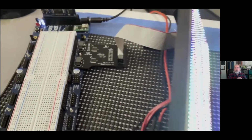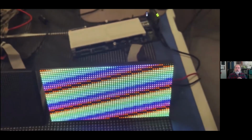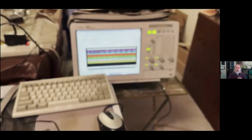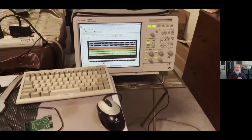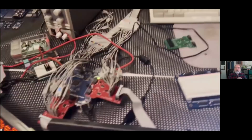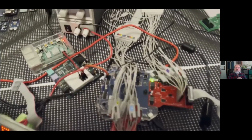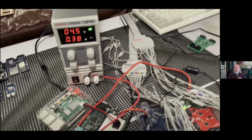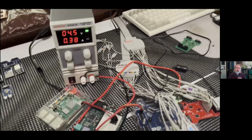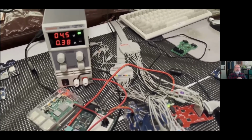And that is now driving this display. And then the noisemaker here, you get the background noise, that's our logic analyzer. We're cabled up right here to these guys. And I just pick which one I'm listening to at the time and capturing traces. And then a standard bench power supply, so I can tell what kind of amperage we're running. And it looks like it's fallen to 4.5 volts. Normally I keep that at 5.